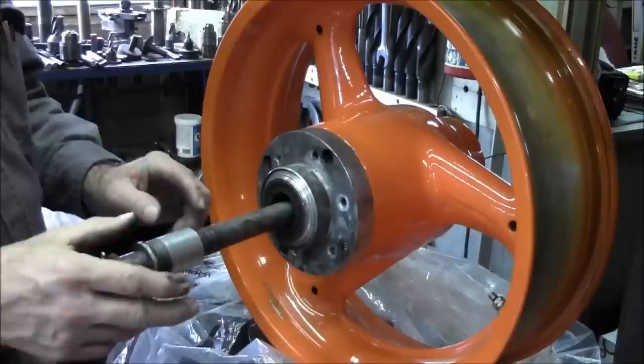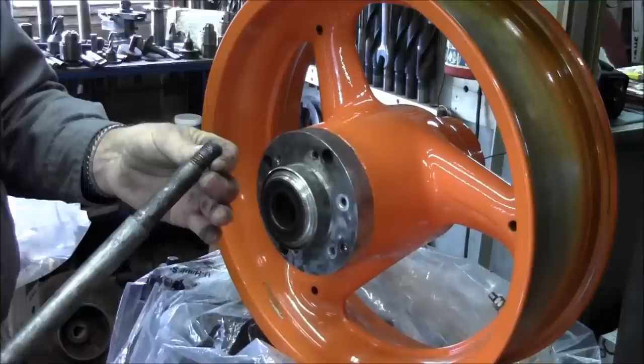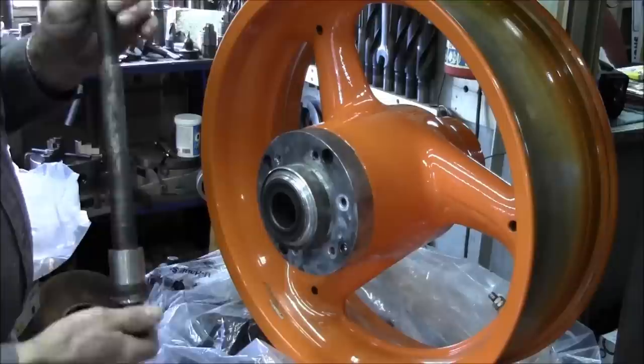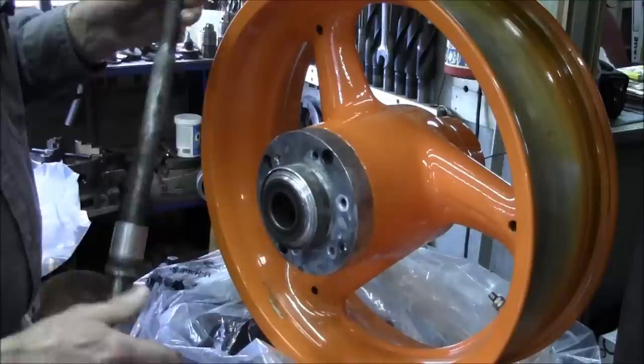And it's got plenty of never seize stuff in there, but some of the wear on here is not necessarily rust or corrosion. It is things that have changed, like this bearing right here in this plate. This looks pretty dry, crusty, and it has spun on there. So we know that diameter is pretty well shot.